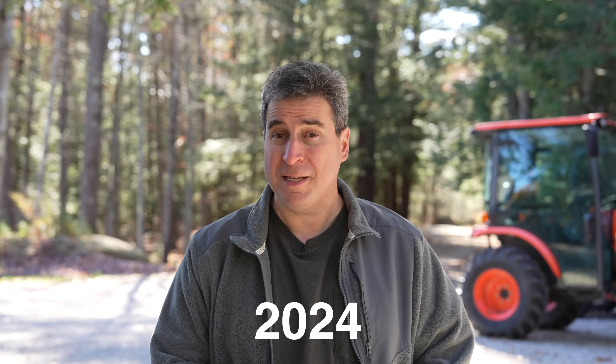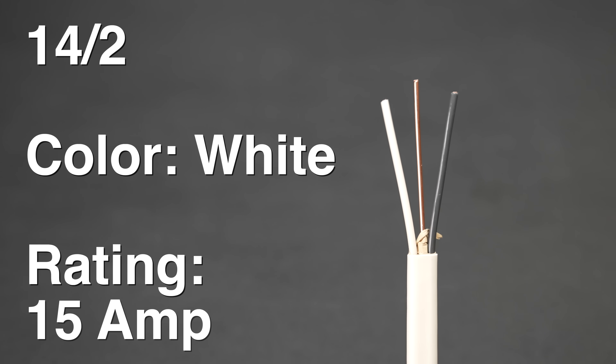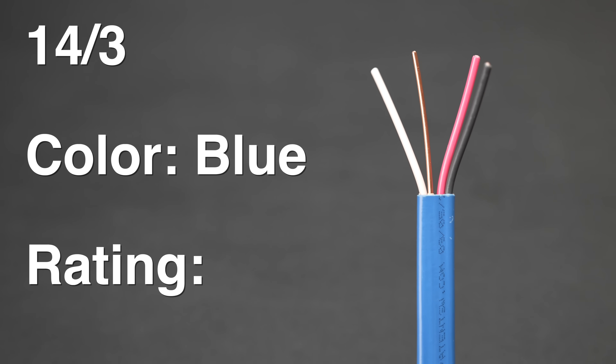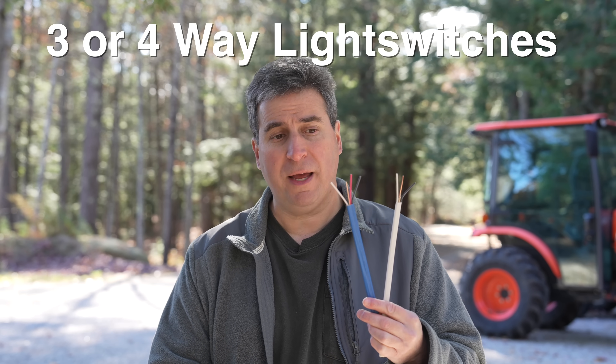Fast forward to today, 2024, and they've come up with a whole rainbow of colors, some of which are pretty crazy looking. The goal is to help differentiate which cable is which. White remains as the 14-gauge 2-conductor cable capable of carrying 15 amps. Now we've also got a blue cable, which is also 14-gauge but with an extra conductor making it a 14/3. You'll typically use it in a three- or four-way circuit, and the red wire will often become what's called the traveler wire.